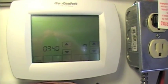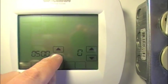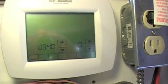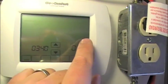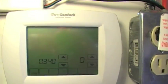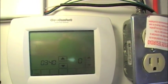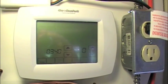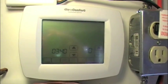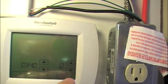Item 340 is remote sensor in case we have an outdoor temperature sensor — we do not, so we'll leave that as zero. It also offers options: one for display-only outdoor temperature, two for an outdoor sensor that could control a heat pump — useful for an air source heat pump that can't operate below a certain outdoor temperature — and three for an indoor sensor.